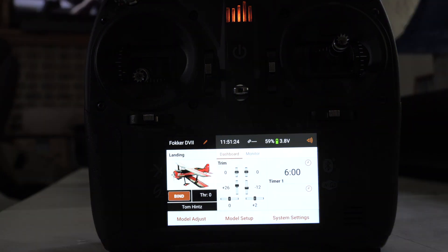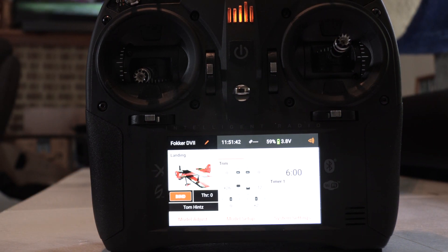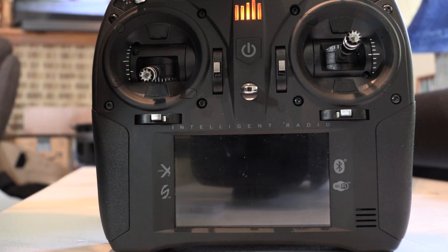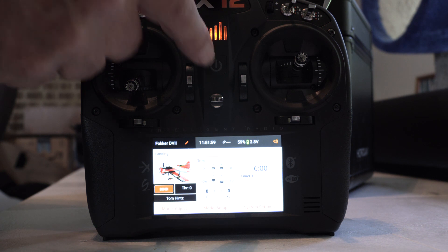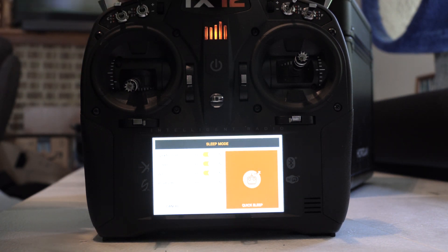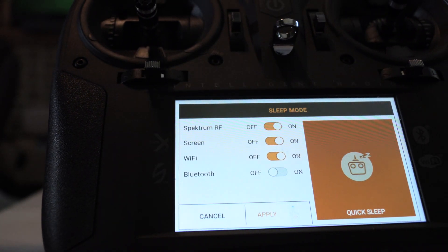When we get to the fancy-looking screen we can make all the adjustments we need to the airplane. New to the iX12 is this color touchscreen, and this is probably the biggest power user in the radio. A lot of people say the battery doesn't last very long — the touchscreen can draw the battery down pretty quickly if you leave it on all the time. But we don't need it on all the time. When you're not making changes, just touch the power button once and the screen goes out. With the screen off, the power draw is very much like the DX9. Hit that button twice and you bring up sleep mode, which uses even less power, and you get to choose what you want sleep mode to turn off.